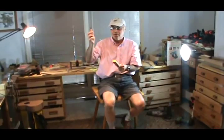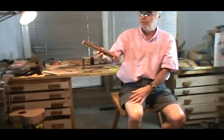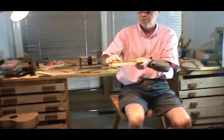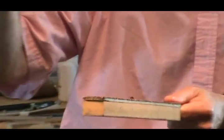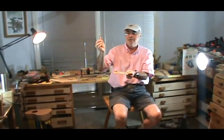To maintain the sharpness of your knife at your luthier's workbench, I always keep a block — just a piece of pine or a piece of particle board — with a thin piece of leather charged with red jeweler's rouge. I constantly sharpen the knife as I'm working. You might want to keep this at your workshop table to constantly keep this knife really razor sharp. I'm sure you'll find a lot of uses for this homemade knife. If you have any more questions, please email me at www.ateliertommy.com.